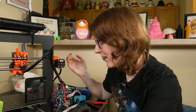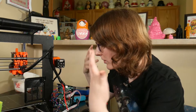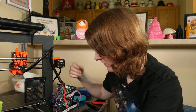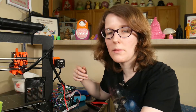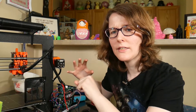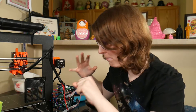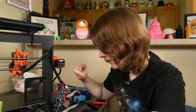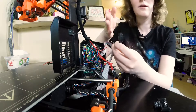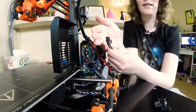So then I was like, all right, I'm just going to look at the board. Maybe there's a short on the actual board. I unplugged the thermistor and then I was like, I'm going to unplug the bed. And I was like, yeah, there's definitely no short here — everything's really, really tight, it's a really tight connection. I'm pulling and pulling, and finally I got it out, and that's when I saw this melted connector.